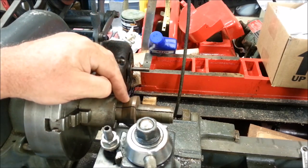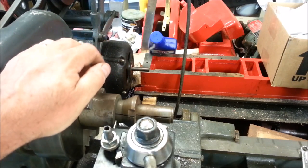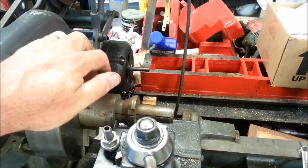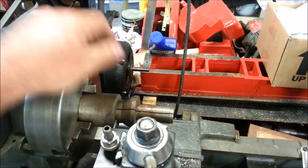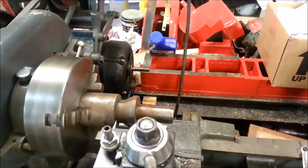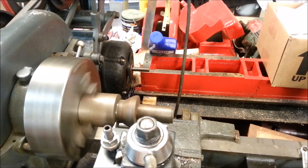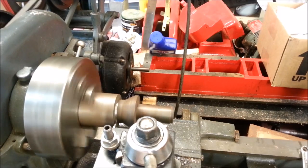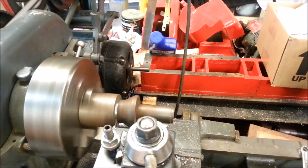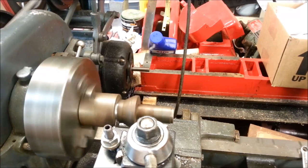Now I'm concerned about which chunk falls off here first. So I'm probably not going to finish the cut with the cutoff tool — I'll probably finish it with a hacksaw, so that I can really see what's going on and not have a big chunk of something flipping around on the lathe. Lower the speed to the minimum. Got an interrupted cut on a cutoff tool. I've got that cutoff tool hanging out there a lot. Maybe I can pull it in some. I'll just take my time.